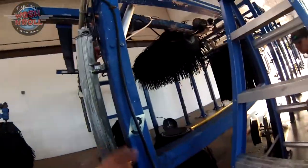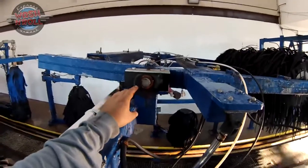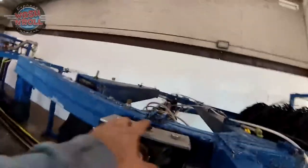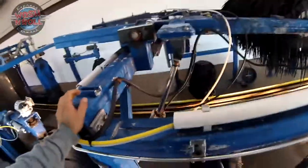This is our top brush, and there are multiple spots to grease on it. The first spot is up at the top — you'll see these black stoppers with a stainless steel shaft in them. These are very important to grease. There's a grease zert at the very top on either side, so make sure to grease both sides. If we don't, it's going to be a real pain to replace them.